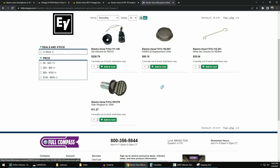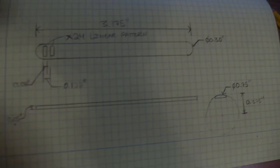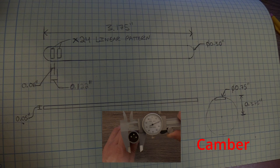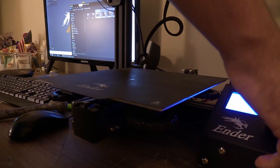Since I already owned a microphone that had this missing piece intact, I was able to make some quick measurements with my calipers and make a quick drawing. The grill is a very thin piece of plastic with a slight camber that matches the profile of the microphone, and there are 24 slots evenly spaced within the piece. I then modeled this on my computer in 3D modeling software. Then I had my buddy John come over with his 3D printer so we could print out a couple.